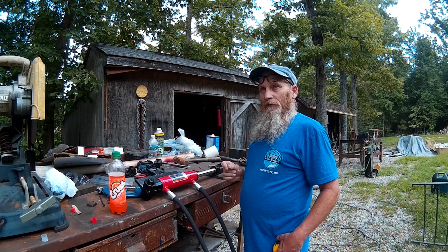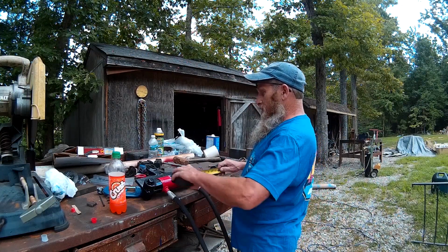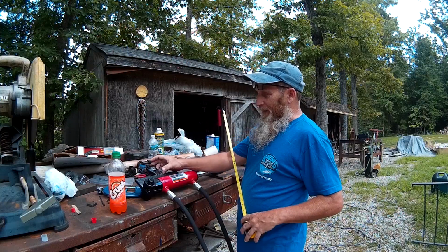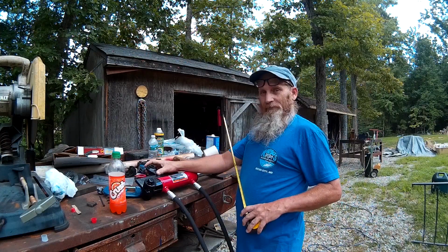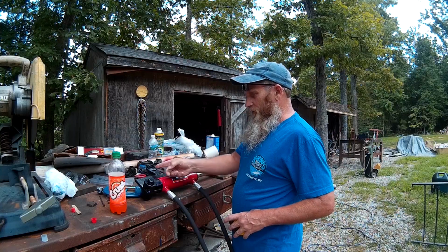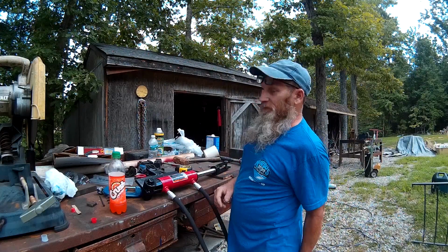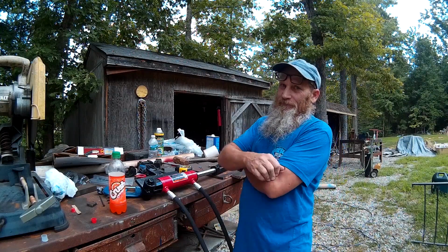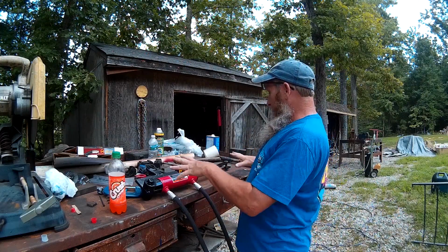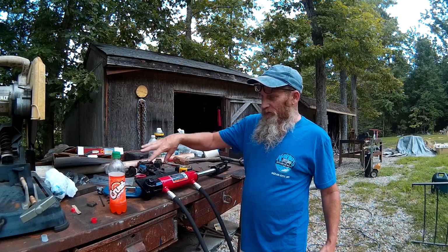I think it was 17 3/4 inches, and then with this set 3 inches in, I measured from the top of here to the center of here, and I set this so that this would hit at 17 3/4 inches. I marked it on this piece of metal, the front end and the back end, and then took it in the shop and welded it in place. That should get me close enough. That should get me within probably 1/4 of an inch by the time it's all mounted to the tractor. So I just wanted to share how I came up with where to weld this piece on here.